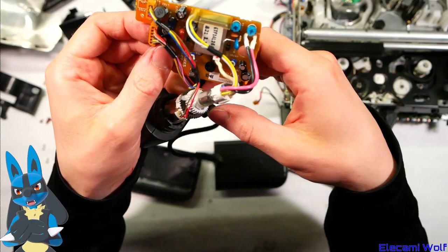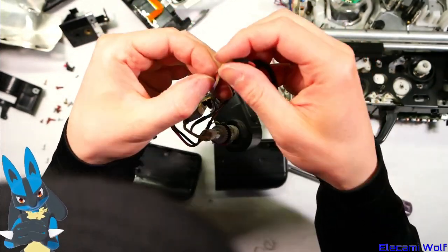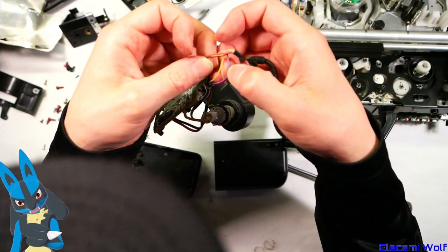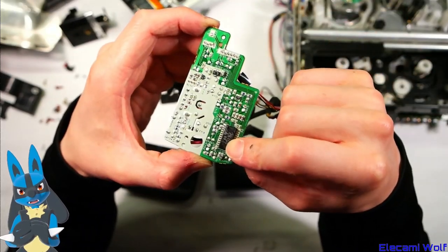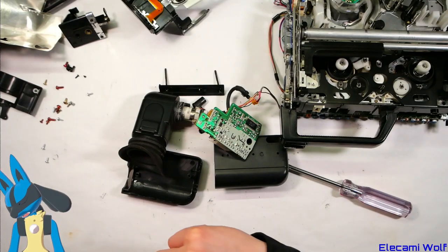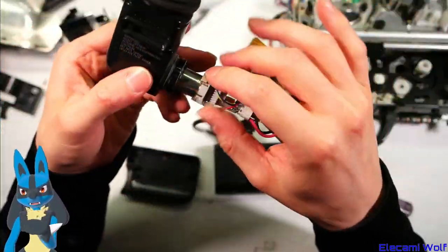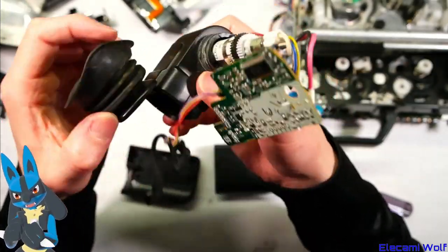Usually it'd be a power and a ground, a video, maybe two, another power supply, and then it will have horizontal and vertical sync pulses coming out of it. That does sync separation so it can provide H and V sync pulses, which then get used by the character generator on the board to make the little on-screen display stuff that's synchronized to the video. And there's a little CRT in there.